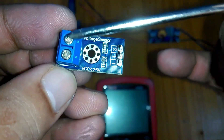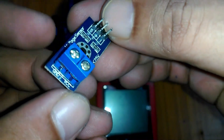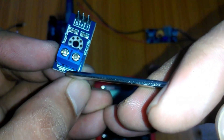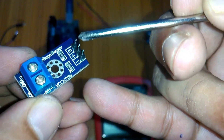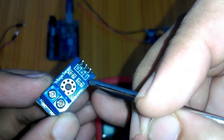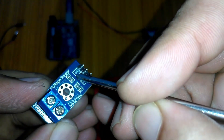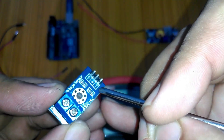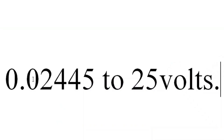As you can see, on one side we have a block terminal — that is where we connect the voltage and ground wires coming from the battery, solar panel, or any other source. The voltage wire is connected with the VCC terminal and the ground is connected with the ground terminal. On the other side we have three male headers labeled as S, Plus, and Minus. The S pin of the sensor module is connected with the analog pin of the Arduino, and the Minus pin is connected with the ground of the Arduino, while the Plus pin is not connected.